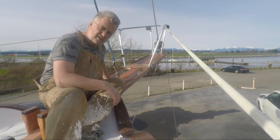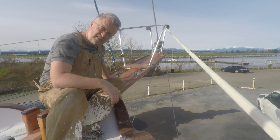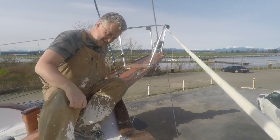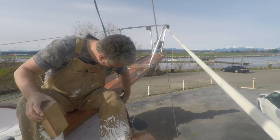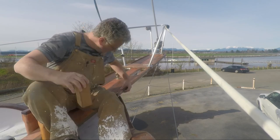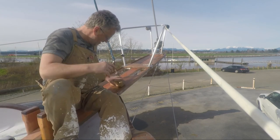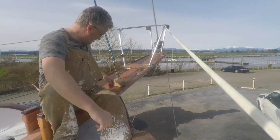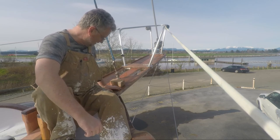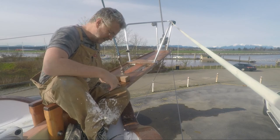Fortunately for me, one of the guys here in the club has a drill with a right angle head. So I used a short bit, right angle head drill, cleaned that hole out. Then I put, it was very technical, I put a pencil in the hole and made a mark underneath. And then from that hole, I marked the side right there. And from there, I measured the same distance in that the other side is, and the same distance along. Squared it up, held my breath, drilled a hole, dropped the bolt through, lined up perfectly.